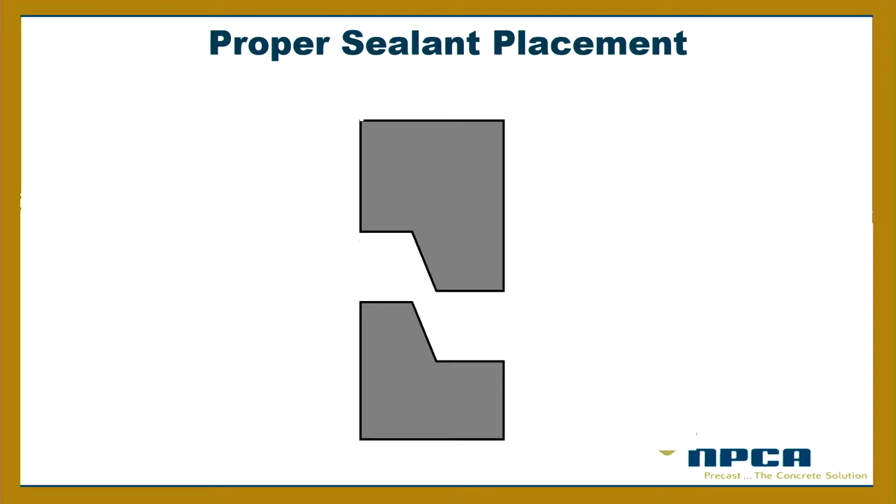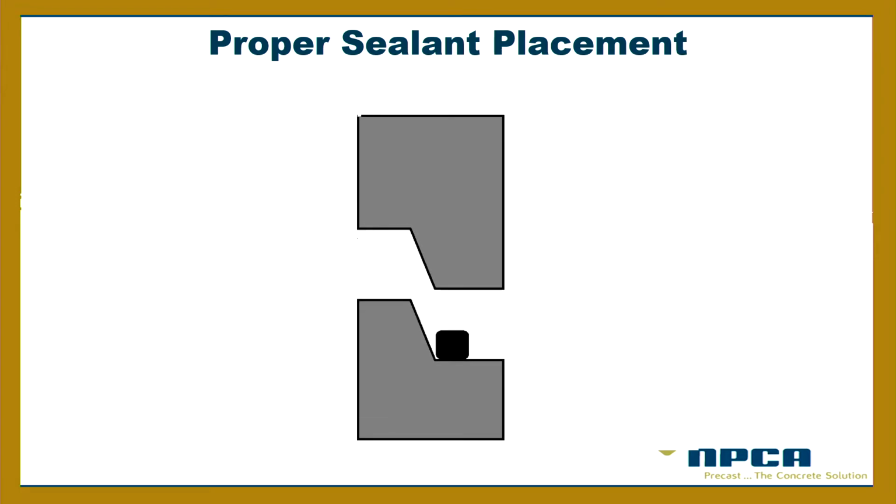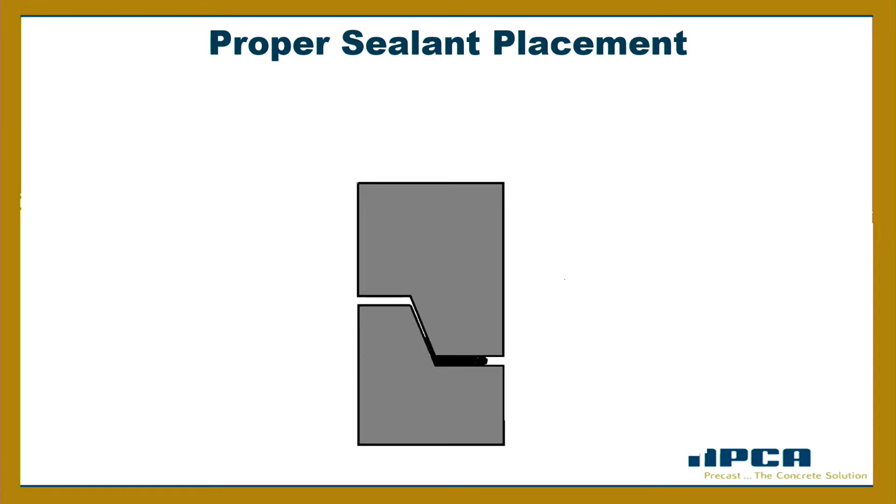And then when it comes to the sealant, I don't know why some people do this, but they like to put it right on the outside. I'm going to put it right there so that people know it's right there, because once I put the top section on, it's going to ooze out and a bunch of it will be hanging out. Well, guess what? The effective area of that sealant, we want to try to keep within the joint system. It doesn't do us much good for it to be oozing out of the tank, all right? A little bit of it's okay, but I've seen some tanks where the whole thing's oozing out of there. So now you've got just a little bit inside the joint, right? So instead of doing that, why not move that in a little bit? See what I'm talking about with the oozing? Put it in there. It's supposed to be in that annular space. Now, even if you don't have this joint system, just keep it towards the center or use 2 ropes.